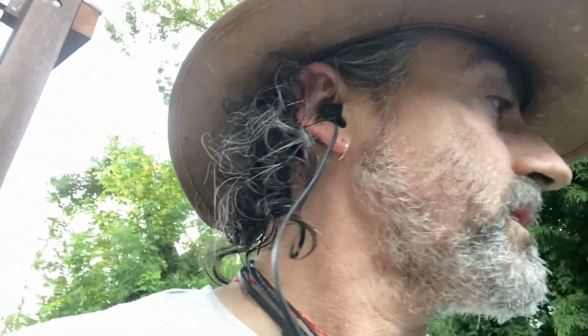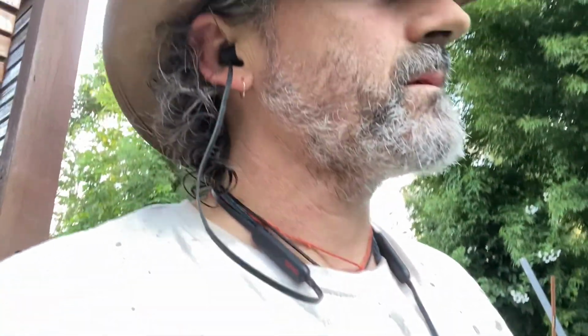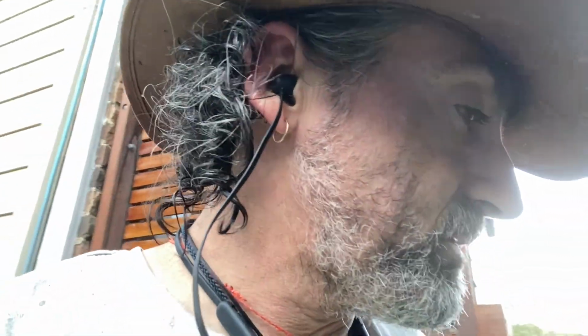Power also tripped out at one point, and it was only the ground floor, and turned out to be my extension lead. I thought it might have been the plug I'd plugged it into, but the mixer just stopped working, and then my wife messaged me and said power's out, but all the lights were still on and everything. Went and checked the box, and it had tripped, because I unplugged the mixer and it still tripped. I unplugged the power cord and it didn't trip, and then I plugged the power cord into the shed thinking it might have been this power point, and then it tripped off the shed.